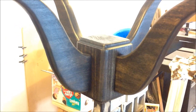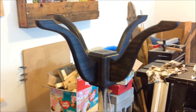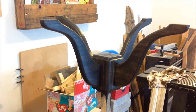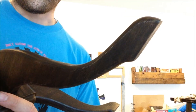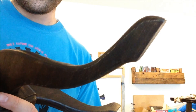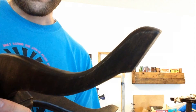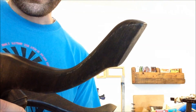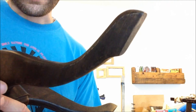I'm gonna do a very light sanding and then finish it with some wipe-on poly. I used 500 grit sandpaper and it rubbed the stain right off — the stuff must have barely even soaked in at all. So it looks like I'm gonna do another coat of ebony stain after all.